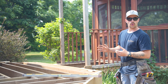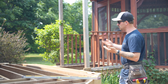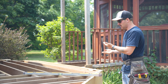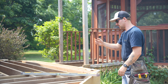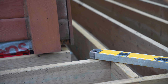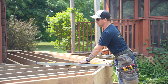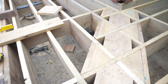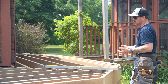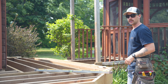I'm working on our corner transition detail. The decking runs perpendicular to the house on both planes and what we're doing is basket weaving the pieces as they join down the center. I'm using my square in combination with my level to draw a straight line that's perfectly square off the front edge. I'm going to be installing a series of flat blocks as well as vertical support blocks on each side, so the deck boards will alternate overlapping each other as you get to the front of this section.